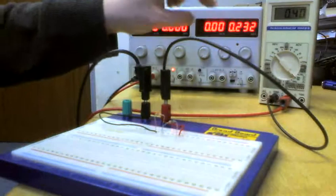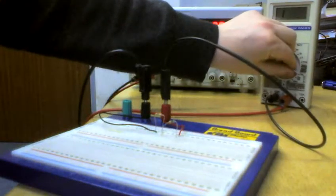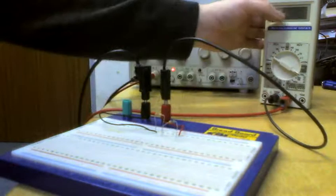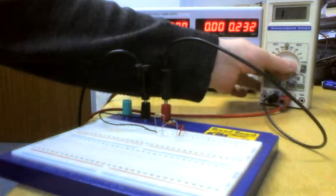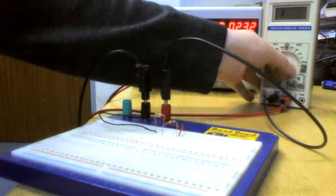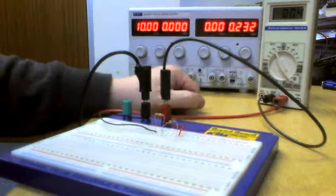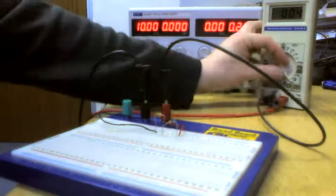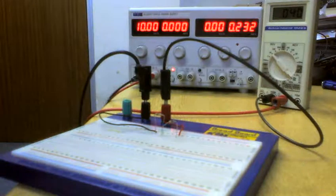If you want, you can try changing the range to get a better reading. If you take it down to the microamps range — since that was a fraction of a milliamp — it's in microamps. But as you can see, it's actually over range: it's displaying a solid 1, which is how the Beckman shows over-range. On the 200 milliamp range you lose resolution. This 20 milliamp range is what I originally had it on, and it reads 0.4 milliamps.